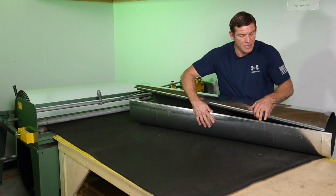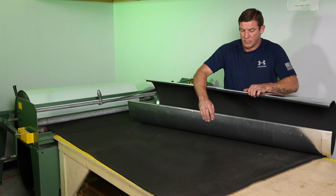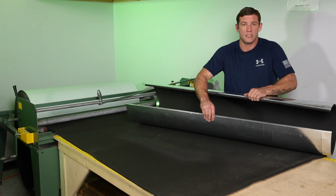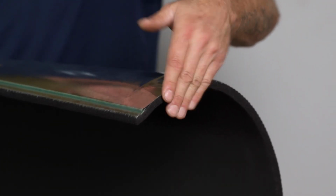But when this is together, this is putting a lot of pressure in between these two parts here. So it actually creates a good seal here, but also it's fully insulated all the way down. It's continuous. On our male crimp side, we run all the way to the edge here. It's running tight to the edge of this pipe.